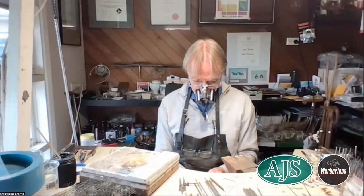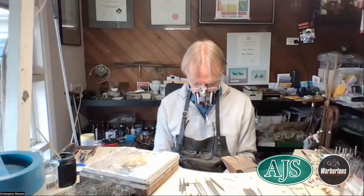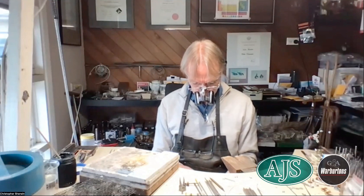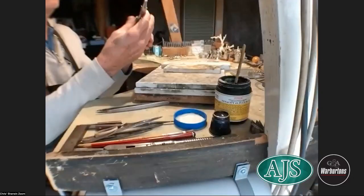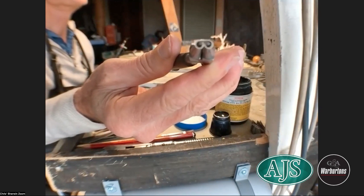And because your round nose are slightly conical, you may have to turn your pliers around so that you don't end up with a conical bend. And that's not too bad. They're pretty good. Just check that. Yep, so now I'm going to put the pliers in both sides. Hold it back up to the camera again, and you'll see that they meet perfectly in the center there.